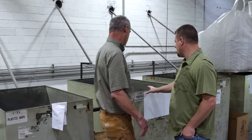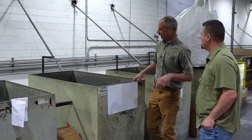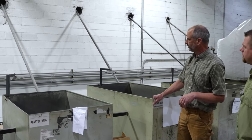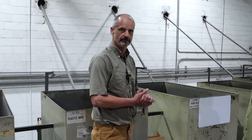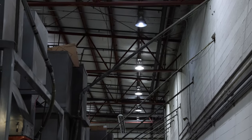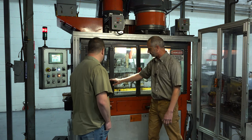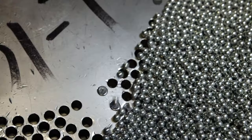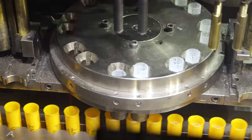All the loaders below are fed from the top side. We have components — hulls, wads — and behind us on this wall are tubes feeding from the powder bunkers. There are 12 individual hardened rooms up there feeding directly to the loaders from upstairs to minimize powder on the ground floor. On a typical loader, all components come in from the top: powder, hull, wad — fed down into a track where various operations happen: powder drop, wad drop, shot drop, and a lengthy crimping station at the end, with quality check beams verifying that powder and shot levels are all correct.